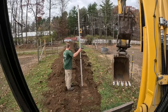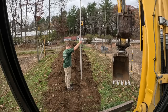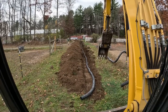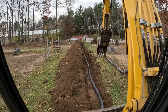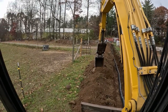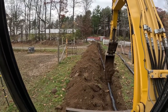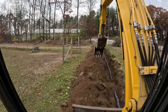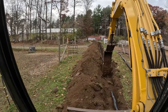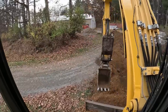Red's going to raise it up and show us the pitch. Two foot of pitch on that pipe - nice. There's our daylight pipe. I'm going to backfill - he's going to hold it as I backfill at the same time. Track it in, pack it in, and grab the tamper and give it another jiggle just because. Normally we'd just track and pack and be fine, but we have horses here - we do not need any issues. So we will compact it with the diesel plate compactor.